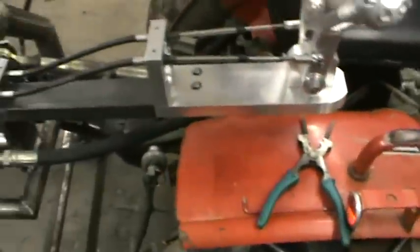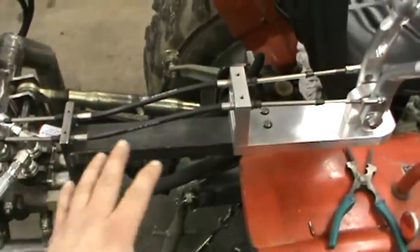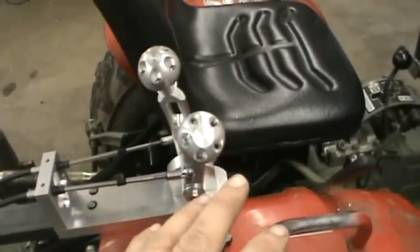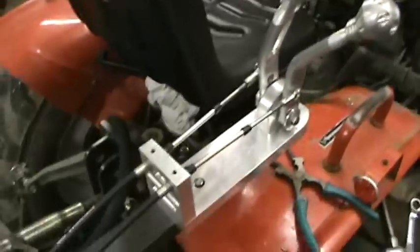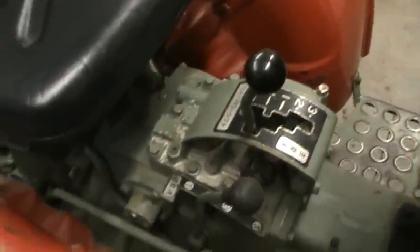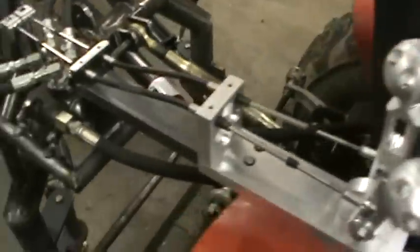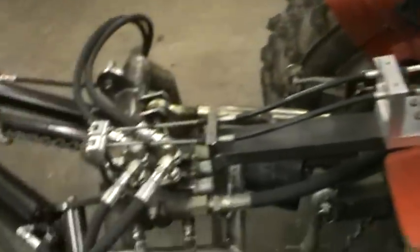When I sat on this, I was planning on mounting it just on the fender and letting the cables do everything. When the three-point hitch raises — set the top link right — it raises completely up just for transport. I'll lift it to transport and then it'll go, and it won't be in your way. But I got carried away on it. We're fixing to hook it up to the tractor pressure and return line. This little tractor does not have an add-on hydraulic for this — there's just no room — there's so much stuff in there. This is the only implement I have that requires hydraulics, so that's just why I put the control valve right on the machine.